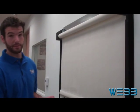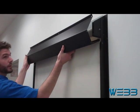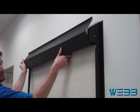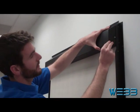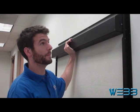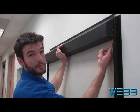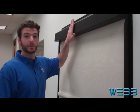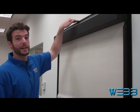Now that the shade is installed and operational, the next step will be to install our angled security box. This bottom lip right here is going to fit up to the bottom lip on our bracket plate, and you'll notice that the angles will match up. Once the security box is in place, we will attach it using the number eight by one half self-drilling screw. There are three holes on the angled security box: two here on the face and one up underneath the bottom lip. Now that the security box has been mounted to the bracket plates, the next step will be to mount the top lip back against the wall so that there will be no access to the roller tube or the shade.